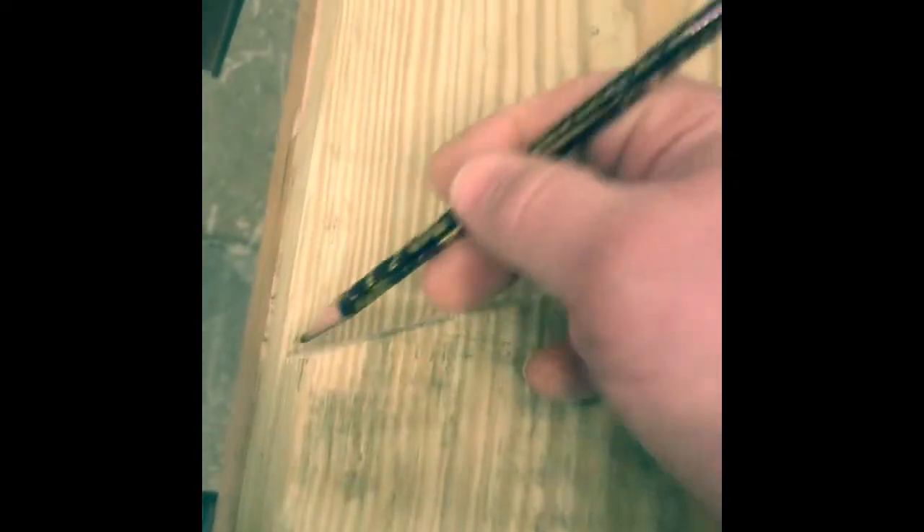Here's a tip: once you've got the first back leg piece cut, you can measure off 17 and a quarter and rescribe your line, or use what's called a transfer measurement. I'll line up the board I just cut and just transfer the measurement off of it. That way I don't have to worry about being at exactly 22 or 23 degrees — the line will repeat exactly the same as the other leg, and I'm ready to cut.